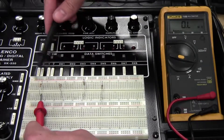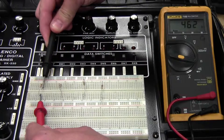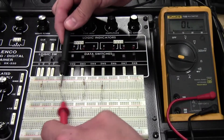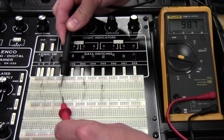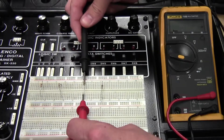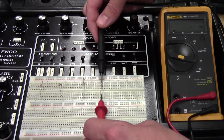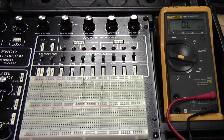With a lead on each side of the resistor, we get a reading of 462 ohms on the 470 ohm resistor. On the 100 ohm resistor we get 98.7, the 510 reads exactly 510, and the final 100 ohm reads 99.7, which is good. They're within tolerance — it's rare to find one that's exactly what it's stated to be.